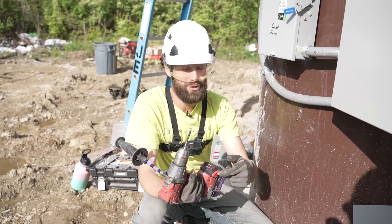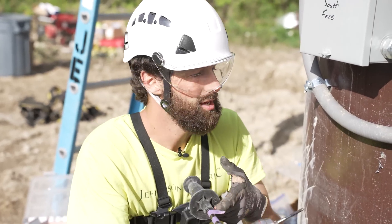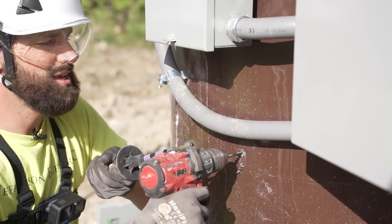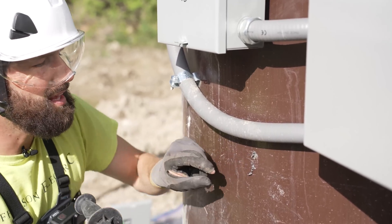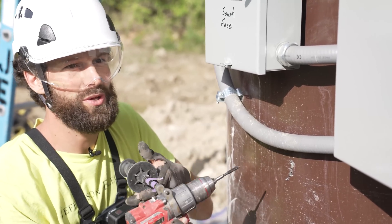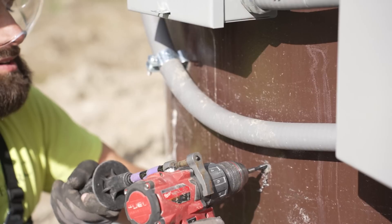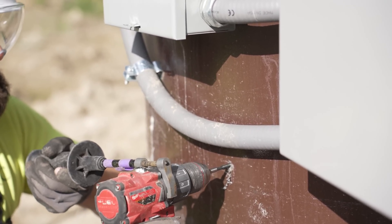The system we found works best through this three-quarter-inch steel is: magnetic drill press, plenty of wax, real low pressure, low speed and low torque on the drill. Chuck it up and put more wax in the hole — just keep cutting implements clean and go as slow and easy as possible. Bruce, if it starts to bog down, just back it up. Let that burr get cleared out, because that's going to jam and increase pressure. We may only have one or two of these, so we can't snap them. Just roll slow — you can feel the pressure start to build.